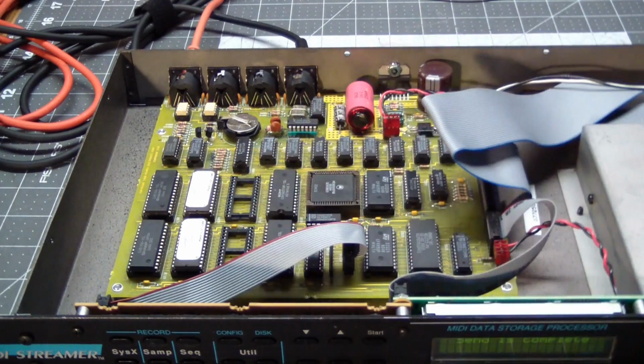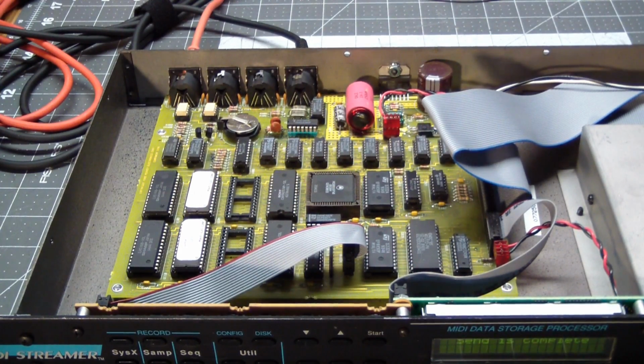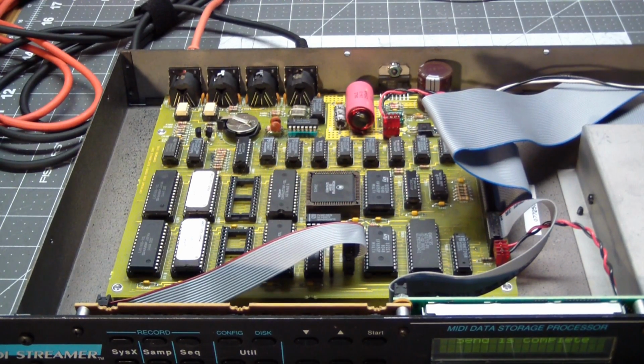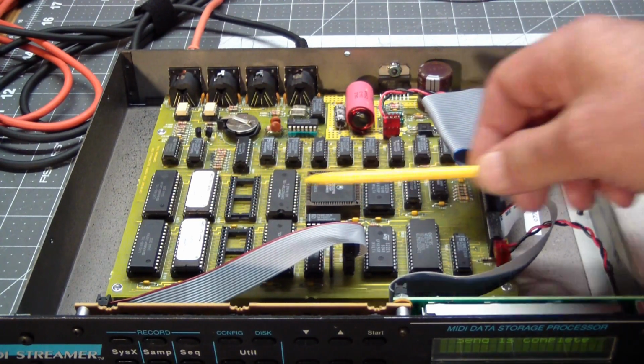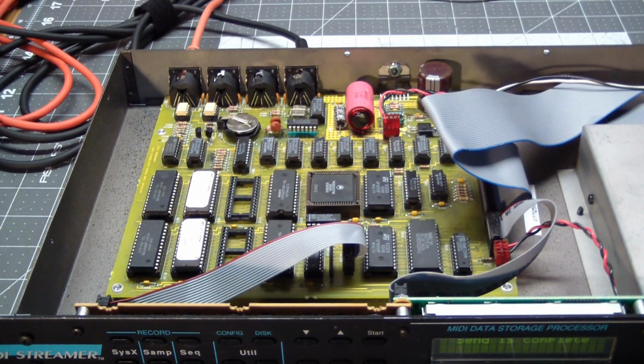Now you need to test these, and it's kind of difficult if you don't have anything to compare them to. How do you know that they work? You'll never know 100%, but there are a few things you can do. You take them and you read them. Stare at the binary dump of what you just read, and if it's all FFs, you just lost, because the EPROM is dead. Now if you actually get data, you'll mostly get random bytes, and that's generally good. If you're lucky, you will actually get readable ASCII text, copyright notices, or text that gets dumped on the screen. And if you see that, then you have a really good chance that you've got a good EPROM. The other thing to do after that, whether you get readable text or not, is to do several subsequent reads of this on your EPROM reader, and stare at the binary dumps you're getting and see if they're changing.